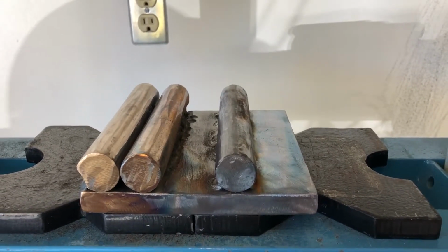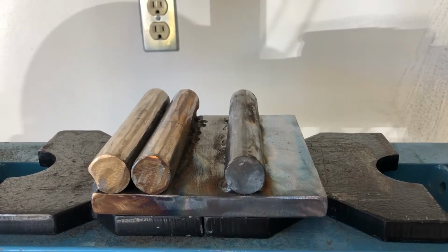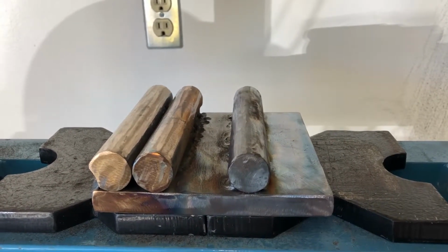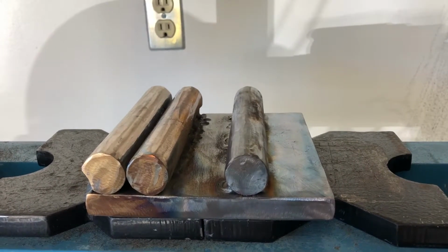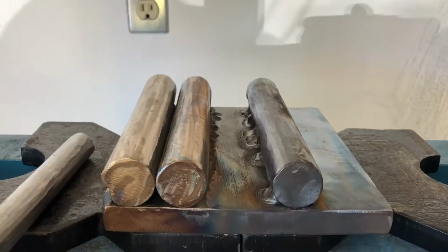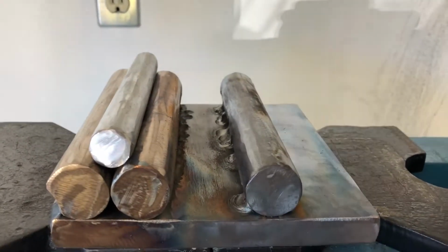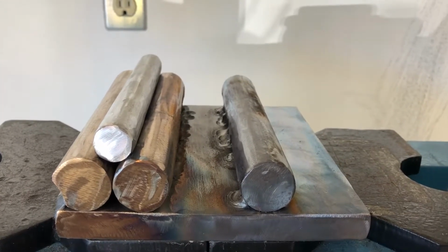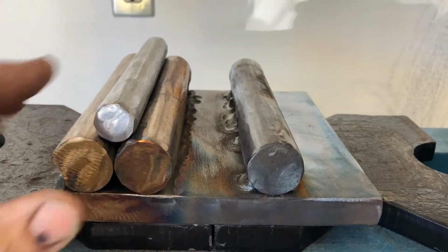So now I'm anxious to test this fixture that I'm using for bending the grade 5 titanium. This fixture is still very hot, but I like that because it'll heat up the titanium when I'm working with it. I've already tested at the end. I used this here to do a bend on the wings or on the extreme edges, which I'll demonstrate.